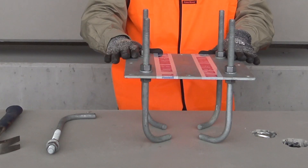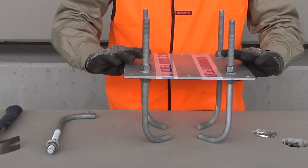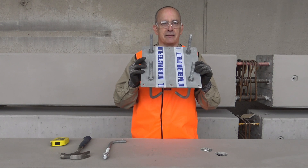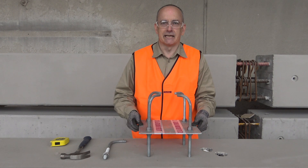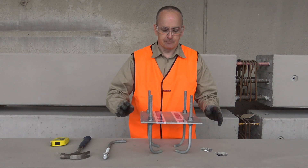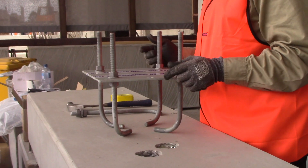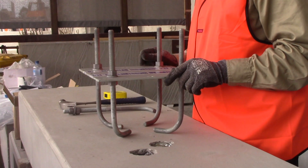You can kind of see from this view why that would be the case. If we were trying to do a far-face install, we would have to try and accommodate the projecting bolts through the base form and deal with that somehow. So it's usually typical that we're installing them in a near-face application and suspending them off form or off bearers to accommodate them at the right height in the panel or concrete element.